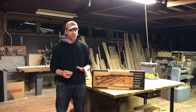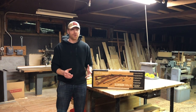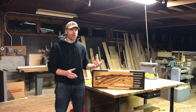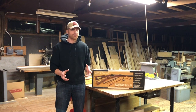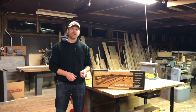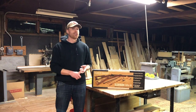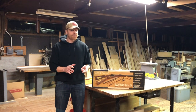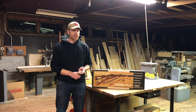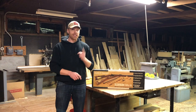It's going to look and feel better, but also if we don't finish it and just leave that hanging out there, it's really going to null and void all the work that we put into other attributes of this project as an indicator of shoddy craftsmanship. Now, this week, we're going to smooth out those transition zones. We're going to progress to finer grit sandpaper around the entirety of the stock. And if there's time, we're going to start polishing the hardware using some of those techniques we learned working on that barrel. So let's do it.